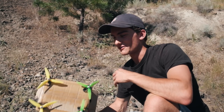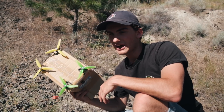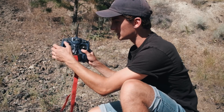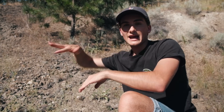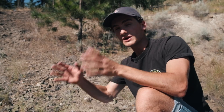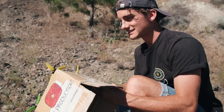I think this might be the end of the road for our trusty box here. I don't feel confident or safe taking it for another flight and diving it down a tree, because I don't even know if I can get it to the tree. When I was flying it around, I was trying to bring it down — the throttle was all the way down — and the thing was taking off and going in weird directions. I think it's because the wind tries to push it and then it counteracts and lifts up. And since this isn't a normal frame, it doesn't really know how to act. As I was flying and landed, it went totally black because the main cable disconnected from the main motherboard, causing everything to shut down, and it just tumbled down the hill. But it survived — this box is actually really strong. I think this is it for our box FPV drone.